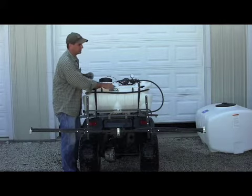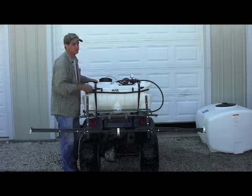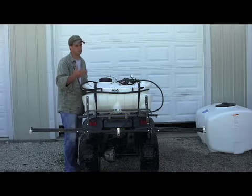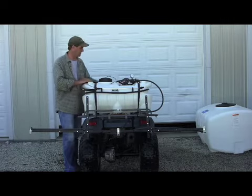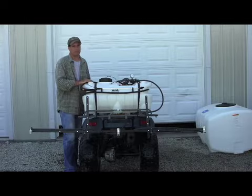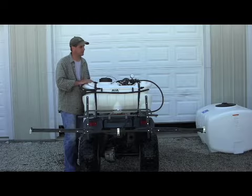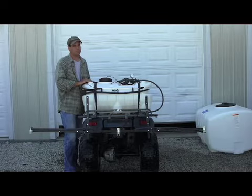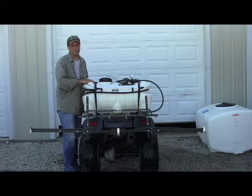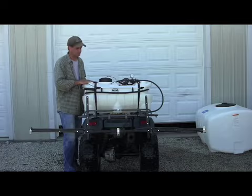So that's what they call when pumps cycle. That means you're not allowing enough product by to keep it running continuously. The pressure builds up in the pump, it shuts itself off and it starts back up again. Most pumps are set up for several hundred thousand cycles. Cycling's common. You'll have that in different applications. It won't necessarily ruin your pump instantly by having it cycle.